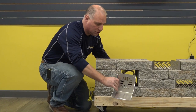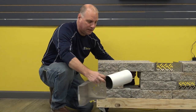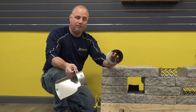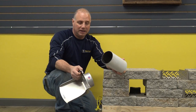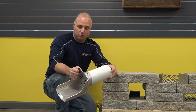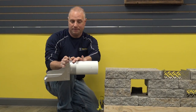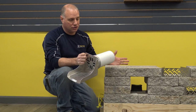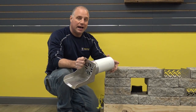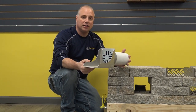It has a nice look to it. It accommodates an SDR 35 pipe, an S&D pipe, or a triple wall — any one of those three style pipes will fit into here. I'd probably glue it in solid. This is going to hook into the back drainage part of your system. It's rare you're going to see a lot of water flowing out through this.